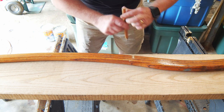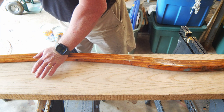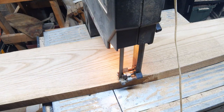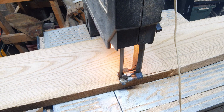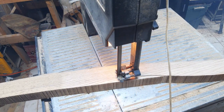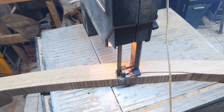I'm also going to leave a lot more material in the back where the tiller fits into the rudder fitting, so I won't have to shim it as much, if at all, and it should be a lot more efficient fit. Since this tiller isn't going to have a lot of direct contact with the water, I feel a lot more comfortable making it out of red oak. But even with a relatively new band on my bandsaw, I had a heck of a time getting through this stuff.